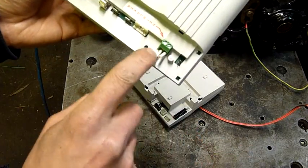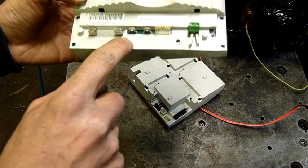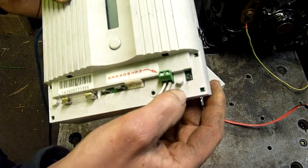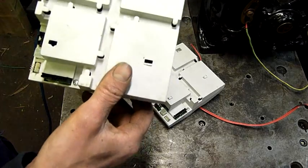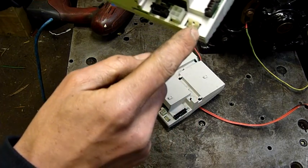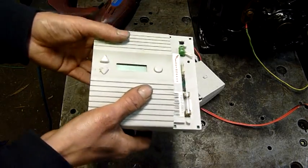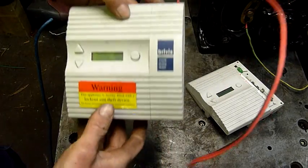It does contain low voltage control input - that's network signal input. 24 volts DC, 24 volts and ground. Optional board, which had relays and things on it. Two amp fuse. LPG or natural gas jumper - I'm guessing that controls flow from the jets, it's probably got a variable gas supply valve on it. These are fairly recent model heaters, about six years old, there was a pair of them. I'm not too sure what these other headers are for, probably control interface. But this lives inside the gas heater itself - you don't see this on the wall or anything. It's all closed up in sheet metal up in the roof structure or outside in some cases. It's a control module for Brivis Australia.